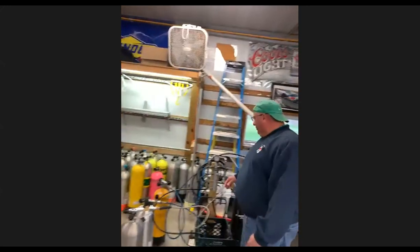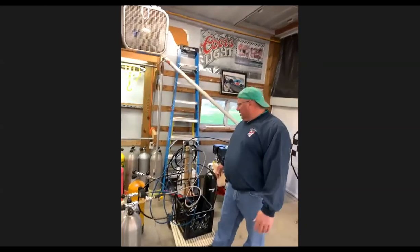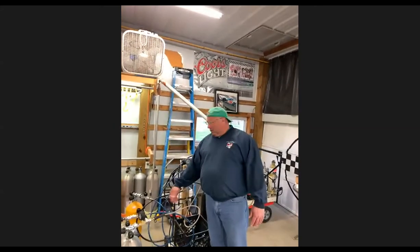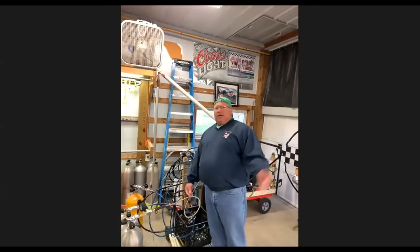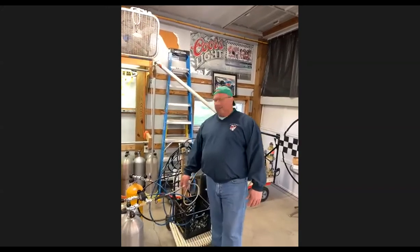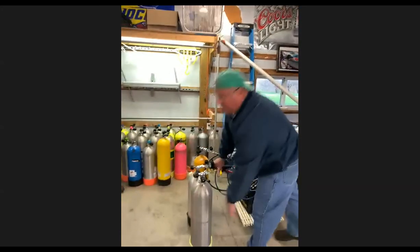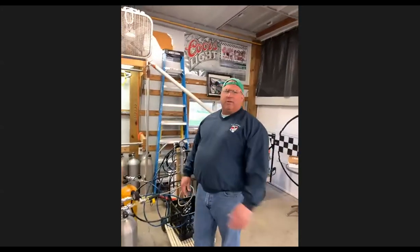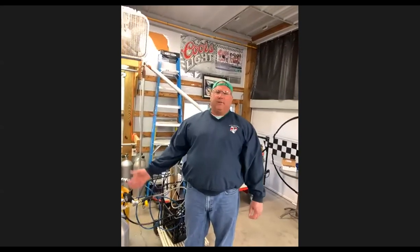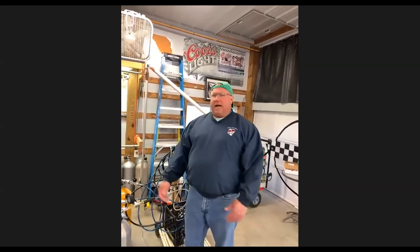We fill a little different than some shops. We don't fill off a cascade, we fill right from the compressor, filled with whips. And from there, it goes up. Sometimes you're going to hear the word hot fill. If somebody hot fills a tank, what they're saying is they're filling the tank really fast, and that's going to build up heat on the cylinder. If the pressure starts out at like 3,200 coming off the compressor, the tank is going to be 3,200 hot. When it cools down, it might be 2,800 PSI.